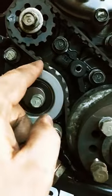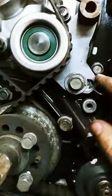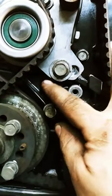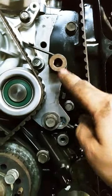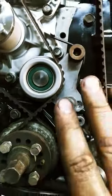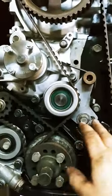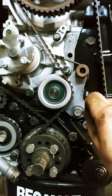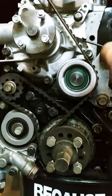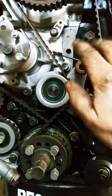Turn this to adjust it, just add tension just enough and you're good to go. Then make sure that this key here is all the way over — loosen this one just a tad, move it over, lock it in and you're good. When putting the belt back on, you want that all the way over. When you get it set, just loosen it and it'll pop right back into place. Don't pry tension, just let it have its natural tension and tighten it down.